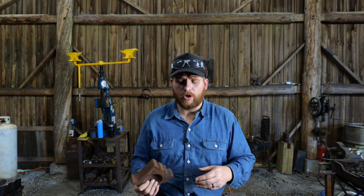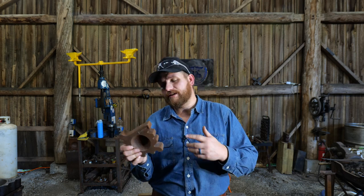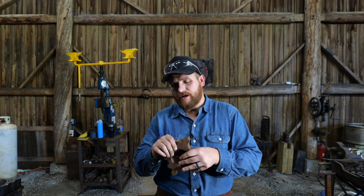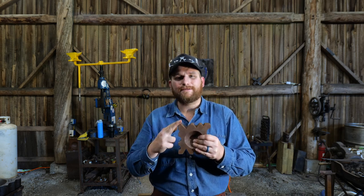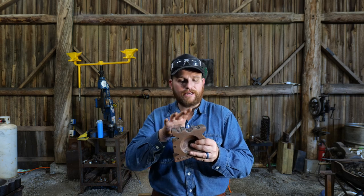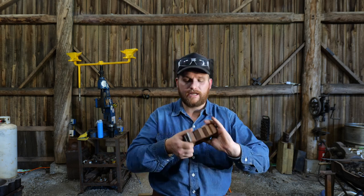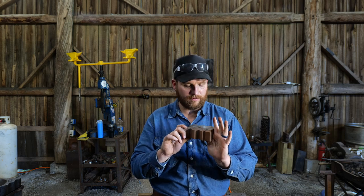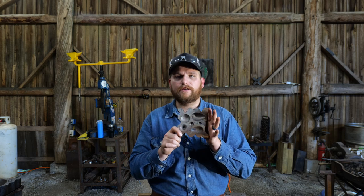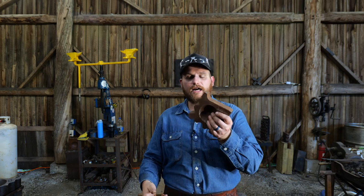Any type of casting like this, if you want to have really smooth ironwork out of it, you do need to dress all the edges down. I have a video specifically on how to dress a swedge block — I'll leave that linked in the description and I'll probably put a card on screen for it. On the swedge block you've got a lot of great 60-degree V-swedges, a scroll starter on one edge, some 90-degree swedges, half rounds — I find those and the 90s to be the most useful in my shop. You also have a bowl depression on one side and a couple of spoon options, some tablespoon options, if you want to make a coffee scoop or silverware.